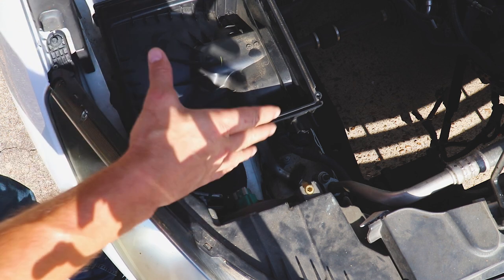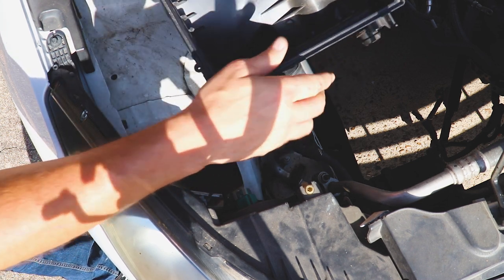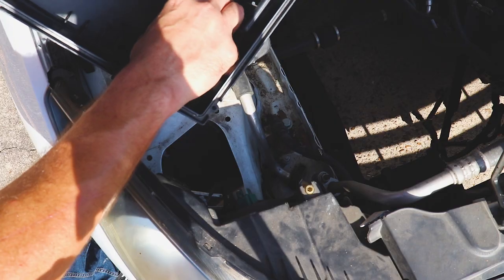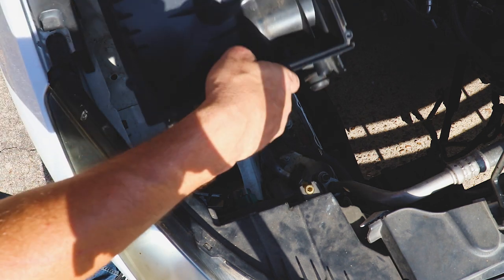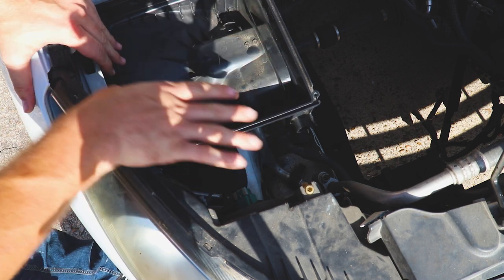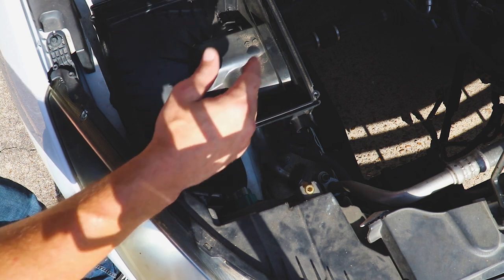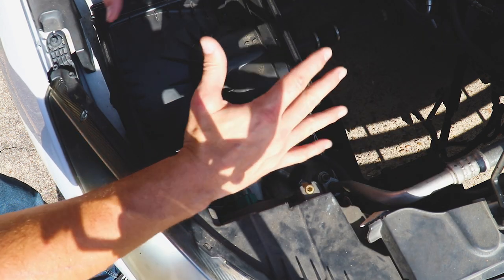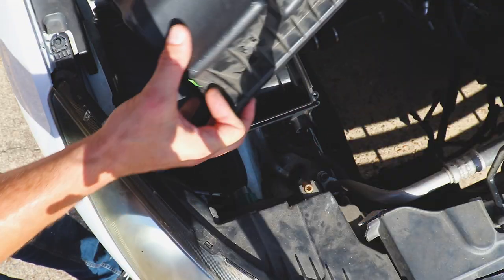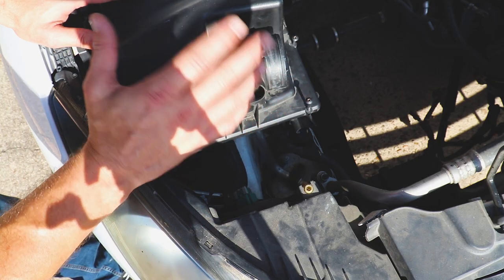At least that's how it's going to be set up at this moment. I'm just going to enlarge this hole so we can use either three and a half to four inches — maybe four inches — and completely cut this out. We'll rivet a tube in there to get fresh air, but it will still have some of its stock function in the sense that any water or moisture will still be able to drain out. We'll be able to utilize a factory-style filter with a K&N filter for this particular airbox. Then we'll completely make a new top because normally the 1.8 takes air at the back, but with the 1.4 it's pointing at the front of the engine where the turbo is.